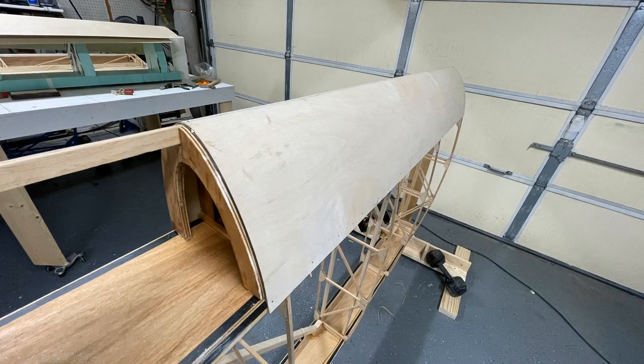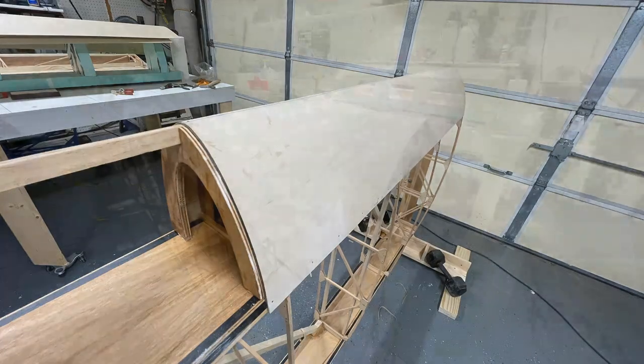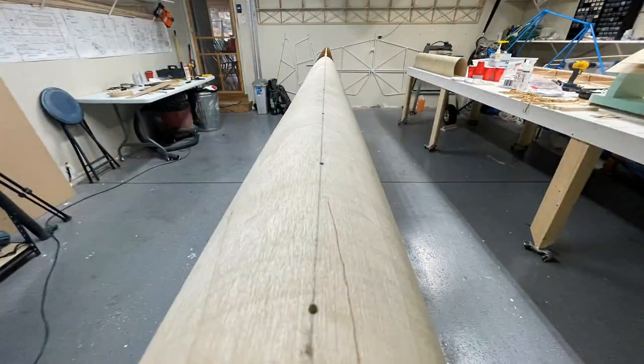On the next skin, from the leading edge forward will be gorilla glue; down at the spar will be epoxy. The gorilla glue is needed because the fit isn't 100% tight — just a 64th of an inch lets daylight show through, which I confirmed with a feeler gauge. If I had a laser cutter I'd have cut the front ribs more precisely. The 3mm birch ply is stiff enough that it left little gaps. I nailed down the leading edge and will center-punch the nails down and put wood filler over them.